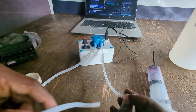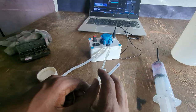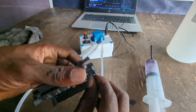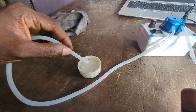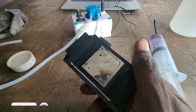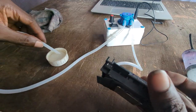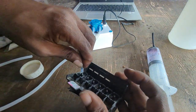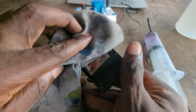So remember, the intake nozzle — this tube — is currently pumping air into the printer head, but this time we want it to pump this cleaning solution. I'm just going to put this here, then put the tip of the intake tube into the liquid. You can see how it's taking the liquid into itself, and then it'll come out on the other side of the head. If it's not pulling up enough, just dip it more into the liquid. If the outtake tube pulls out, just stick it back on top of the printer head and it will wash the printer head.